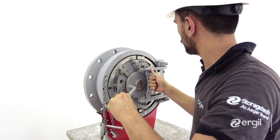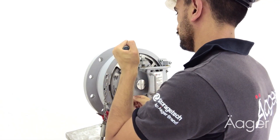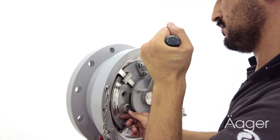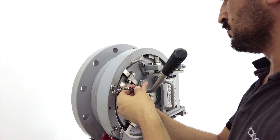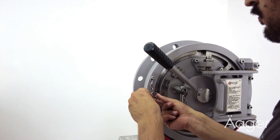The closure process can now start. The door is placed in the closed position. Turn the control lever into the clockwise position. Turn the secondary pressure safety catch lock clockwise to the lock position. Screw the pressure warning device and tighten it. Install the primary locking device and tighten it.